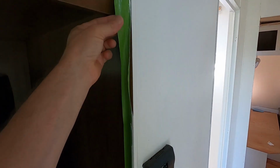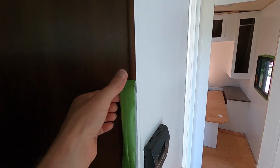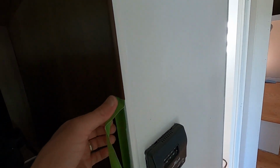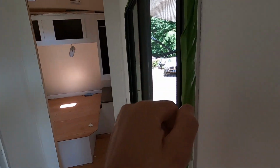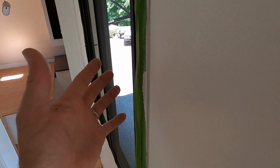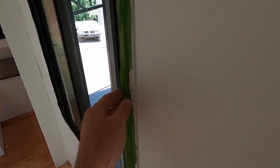The very satisfying thing is once you did all the work to paint this and make it as nice as you can, actually untape it. Just take your time. You can see there's a nice clean line there, but take your time and go real careful. You might even have to take a razor blade and trim in corners because there is a lot of buildup there. The last thing you want to do is rip this off too fast and grab that somewhat wet paint. Still, it's not wet, but it's a little tacky, and rip a giant chunk off and have to redo that whole section. So take your time untaping.